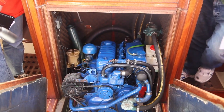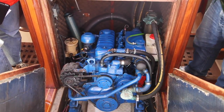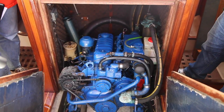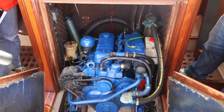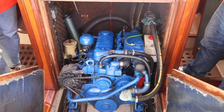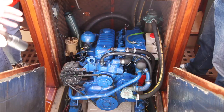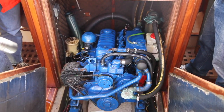Let's begin with diesel engines. Diesels are way safer than gas, and they also will last a lot longer. This is a 50-horse, four-cylinder Perkins diesel, and it's got about 6,000 hours on it. A diesel, if you take care of it, should last you somewhere between 10,000 and 12,000 hours. On a boat, you always talk about engine hours — that's how everything is based.